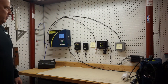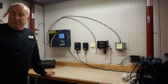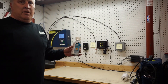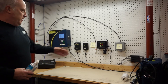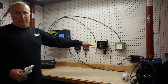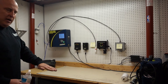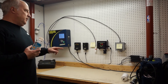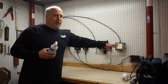Let me get started. What I'm going to do is set up a test from far away. I've measured off 18 feet here in my lab. I'm going to release a certain amount of R-134A refrigerant, which is in this can of duster spray, and see how long it takes to hit the sensors and set them off. It's a bit unfair in that these zone pickups are up high — you typically want them about a foot off the ground because refrigerant drops. I have a sensing point down here and two up high: one is a standard pickup point and one is in a waterproof enclosure.